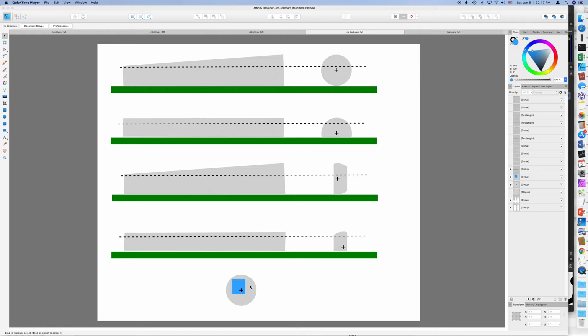The second thing to notice here, and this is what tends to bother me more, is look at all that waste. If you've ever sawn a tapered log without a toe board, and I've done this once or twice when I wasn't paying attention, generally what's going to happen is you're going to make your first and your third cuts, and you're going to realize, man, I am taking off a huge amount of wood down on this tapered end of the log. You might be barely skimming it over on the small end, but on this end, you are wasting a lot of wood. And that really shows up here on the end after you look at the final cut. That's just a lot of wood that you're throwing away.